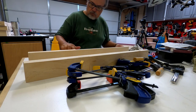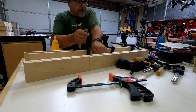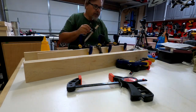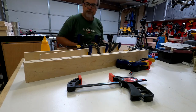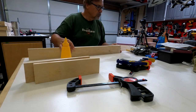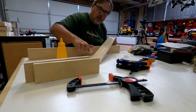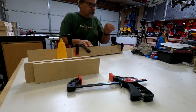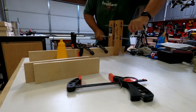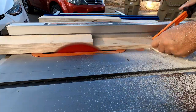The fence that attaches to the permanent side of the table saw sled will be glued together to form about a one-and-a-half inch piece. I used the adjustable piece as a spacer to make sure everything was squared up, but it doesn't always get perfectly squared, which I will rectify in a minute. After the glue dried I took the fences and trimmed them on each side so I have nice square flat pieces to glue down to the base.